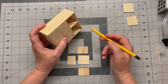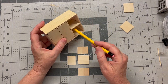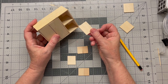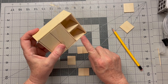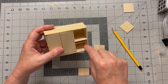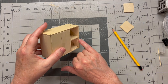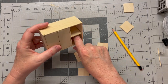When measuring, keep in mind that the drawer front has to fit flush inside. The box you create has to sit back 3mm from the front. When making your base piece, cut it so it is 3mm short of coming flush with the front. Once your base is complete, your back piece goes on next, and then your side pieces have to be cut so they also provide that 3mm space along the side.